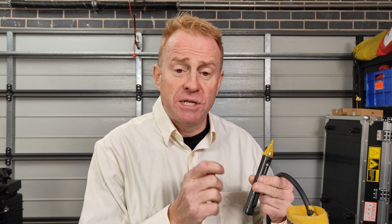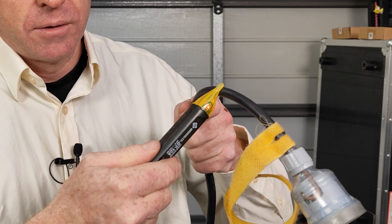That's a double-edged sword — it means we know the volt stick is working but it also means that static electricity can set it off. So if you're testing a cable and it momentarily beeps, that is actually static electricity. In this case it's coming off my floor which is EVA foam mats. Maybe you're on carpet and generating a bit of static and getting a false reading. What you want to hear is a continuous reading.